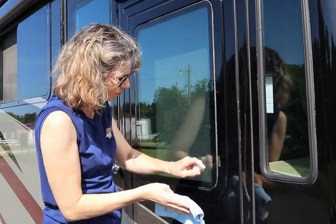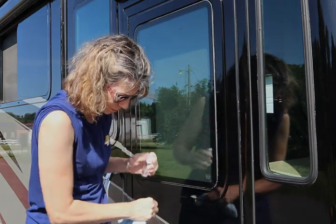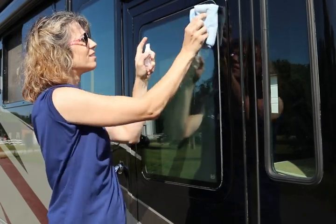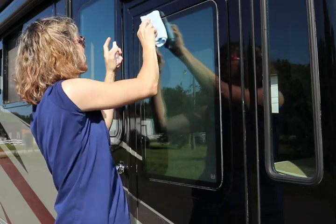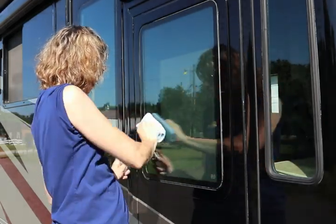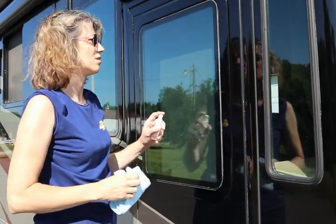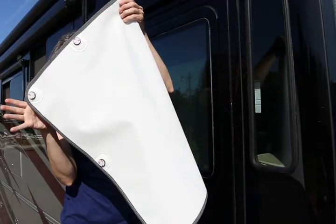Now we're ready for the next step. With your shades you're going to receive a box that'll say Silane. The Silane is a 3M product that creates a monofilm on the glass — it's a binding agent for the VHB adhesive and it also creates a barrier for moisture. Just put a little spray on there. There's roughly about 50 squirts in that bottle, so there's plenty. It doesn't take a lot. The Silane is applied and she'll be ready to install the shades.